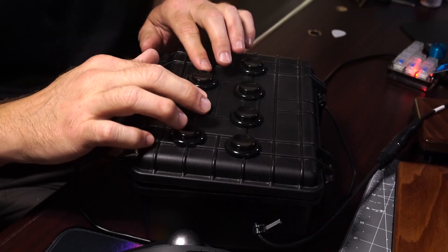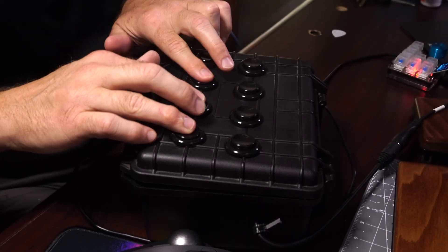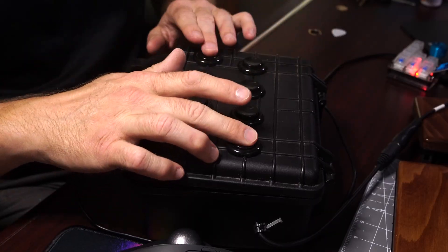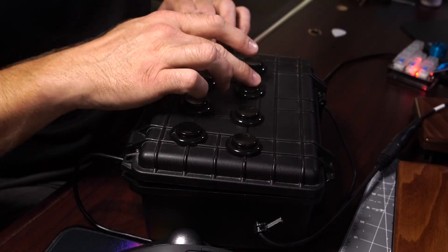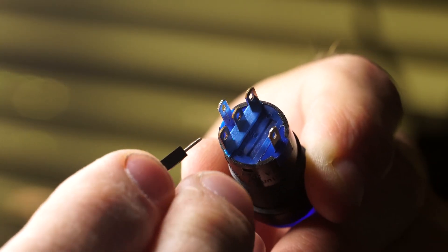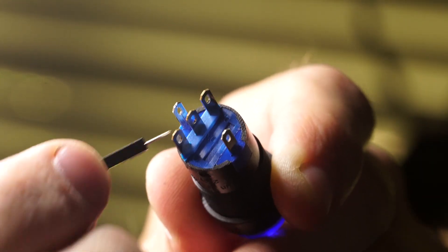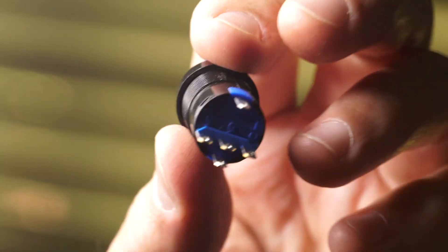This guy adapted the code from another MIDI project I'm working on and put it on here. Fantastic. I feel like I've met the requirements of the minimum viable MIDI device, but there's still a few more things I want to do — like maybe do something with this blue button. You've got common on the bottom side, normally open in the middle, and then plus and minus on the side. I think I'll wire the two bottom connections as well as the side things, and then I can make that into a light and a little switch for something else.